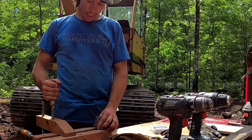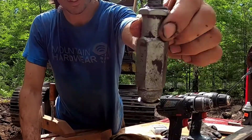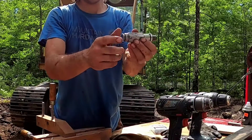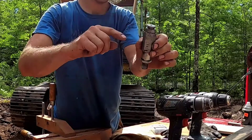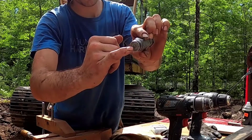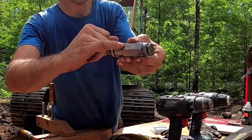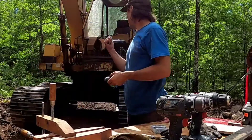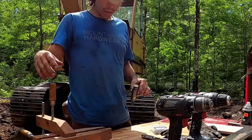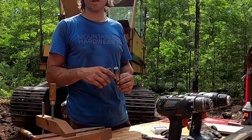Here's the issue I believe I'm having. This here is called a button-head grease fitting, and you would slip your coupler on to here to fill grease, but it's coming out the spout — right there is where the grease is coming out, and it shouldn't. This part is stamped 94; the machine is a 1985, so nine years after this machine was purchased this was replaced. This part from Caterpillar — I called my local dealer — is $100, believe it or not.